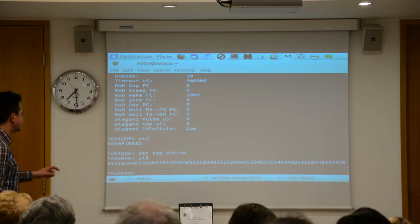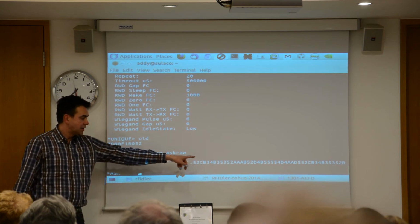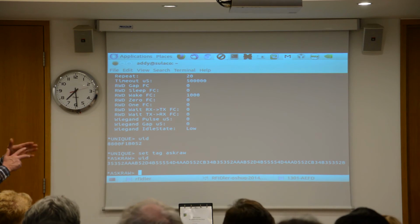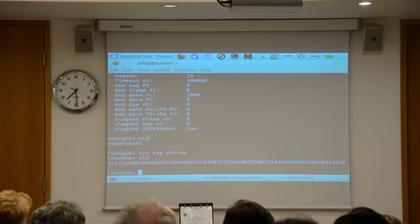And in fact, the fact that it says 555 and AA tells us that it's probably Manchester encoded data, because 5 is 1010 and A, or the other way around, A is 1010 and 5 is 0101. So we know that we're getting a Manchester stream. So you can use this to just look at any raw data and start to build up a picture of what the tag's doing underneath.